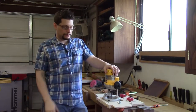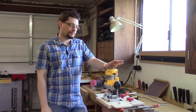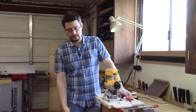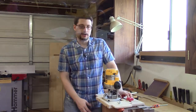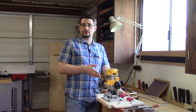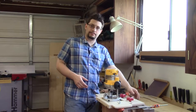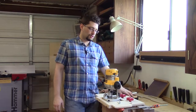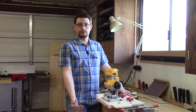I have my half-inch bit in my router. My pieces are clamped into the jig, but it's a really long piece and just too long to hold with the clamps in the jig on the bottom alone. So I also grabbed the jig we used to support cutting mortises in the front legs, along with the fence, and set those behind the jig. I used clamps across to help support holding this piece in, so we have clamping power from both the top and the bottom.